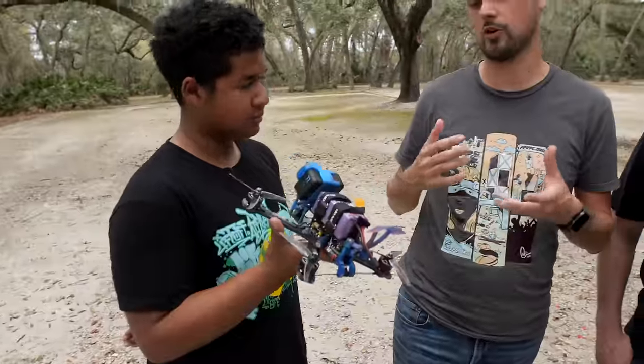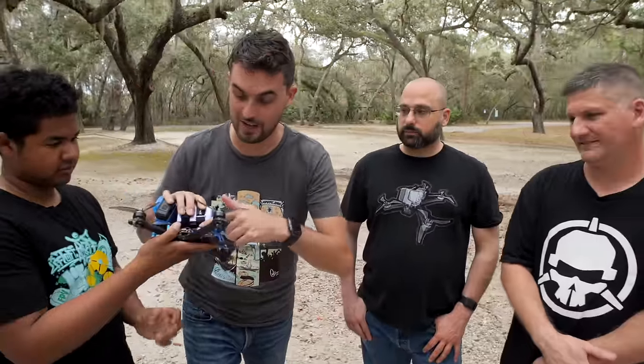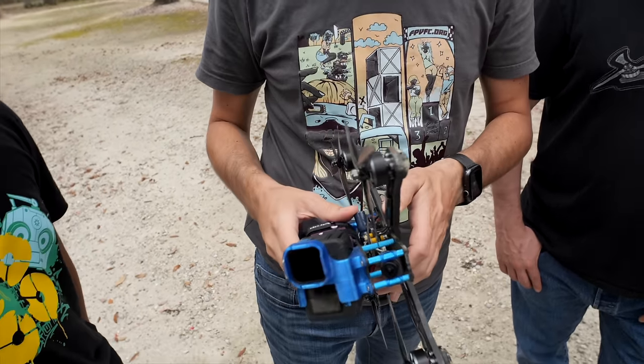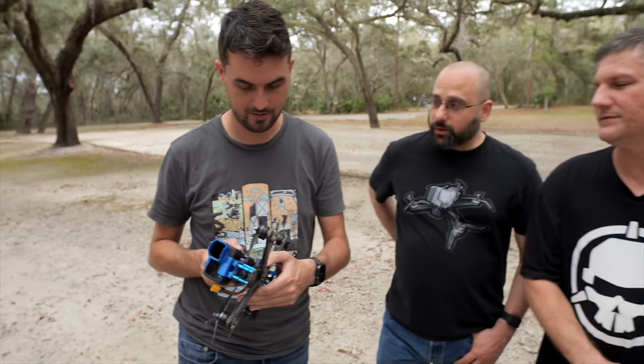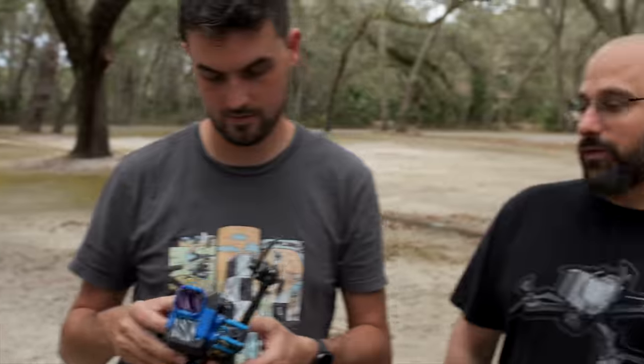Yeah. The real world trade-offs of actually living this, like you said, the more expensive battery, the fact that you have to have this giant capacitor. I mean, holy crap. I fly that on my normal quads anyway. You fly this big of a capacitor on your daily? I fly 1,000 microfarad at 35 volt. Man, that's a big one. That's a 35 volt, not a 50? Not a 50. I couldn't find 50s. Wow. Well, you have no headroom on that.